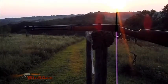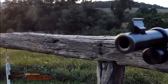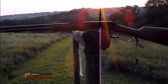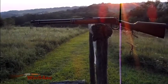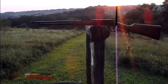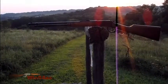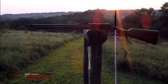One thing I did notice is I was getting some leading in this barrel using that softer lead. So what I'm gonna have to do to make sure I have the proper lead alloy is buy some linotype off the internet, and I'll use that in the rifles. Then I'll just use a straight lead or a little bit hardened lead that I deem appropriately hard in the pistols.